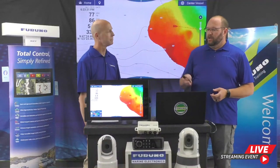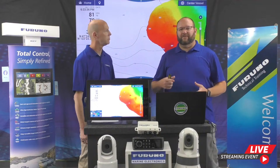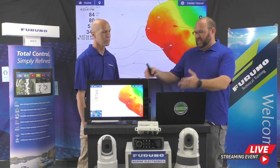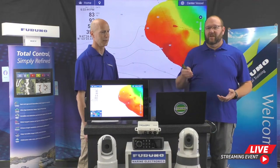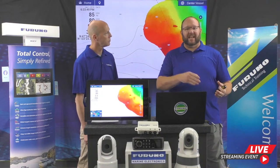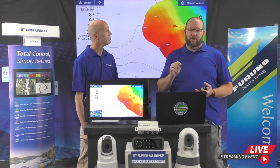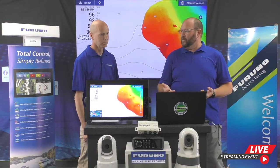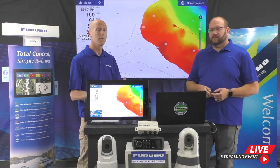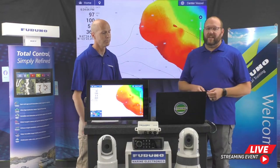Absolutely. Some other things are global settings, things that you probably don't want different on every MFD, or you just don't want to spend the time to set one up and then do the same thing you just did on the one beside it. One of the first things is that welcome screen. You see where it comes up and says let's navigate, demo, or tutorial; press let's navigate. It'll do that on all of them. And when you acknowledge that navigation disclaimer, it does that as well. The same thing's true for all the icons on the homepage that we just looked at. When you set up one unit, all of those icons will automatically appear on any other TZT3s you have on your network. Yeah, it keeps it really easy.